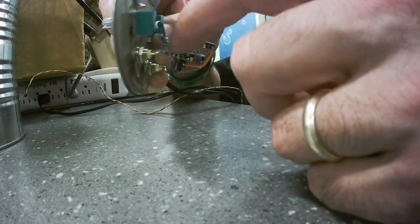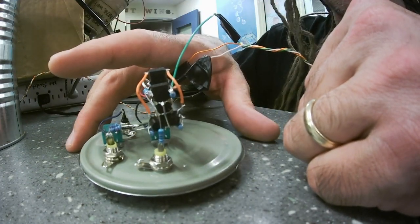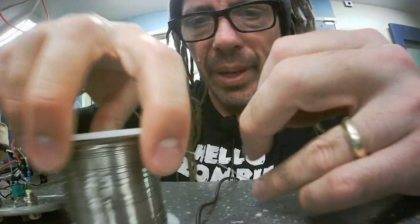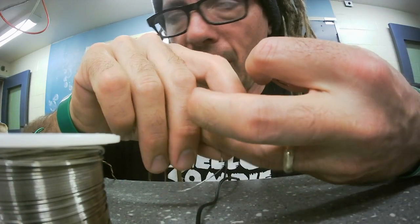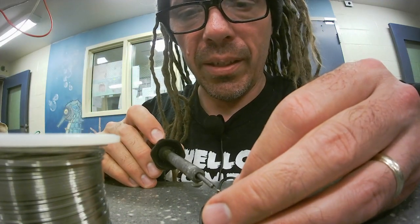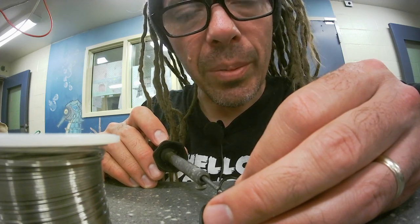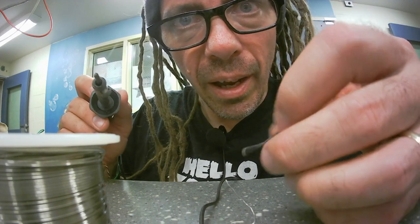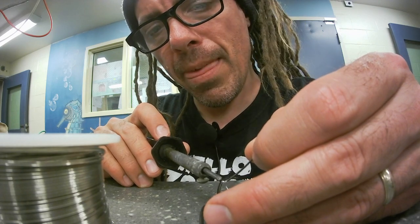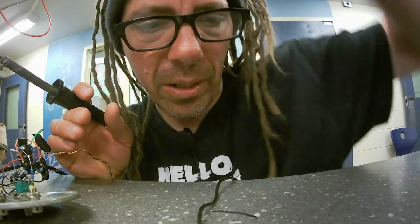I forgot to connect this potentiometer to the positive rail. So I'm gonna hit pause. Okay, basically having me forget to attach the other end of the potentiometer to the positive rail kind of ruins the whole circuit because it wouldn't work as intended without it being connected. So I'll try to figure out how to put a little comment inside the video at that point saying, hey, make sure you attach the high end of the potentiometer to the positive rail